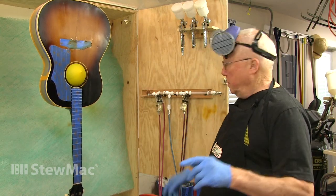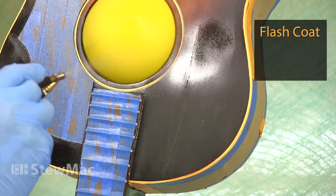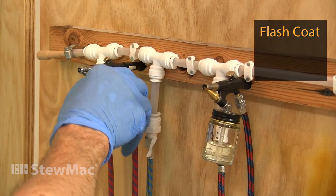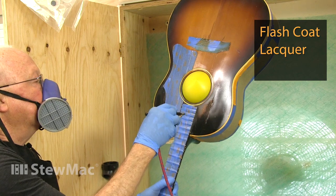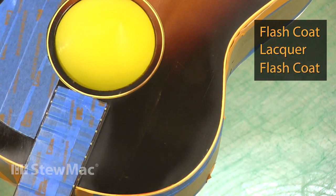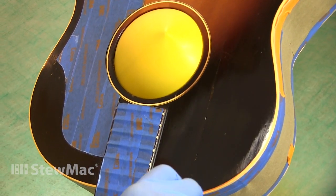So what I'm going to start with is the flash coat and this airbrush. Spray it on that finish in this area to soften it, so it accepts the lacquer, which is in that gun. Hang it up and quickly get the lacquer. Hang it up. Go back to the flash coat, especially on the edges, and blend it in.